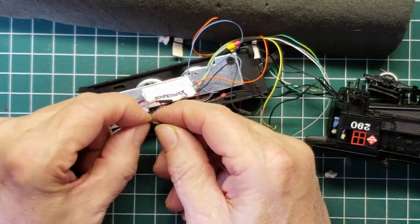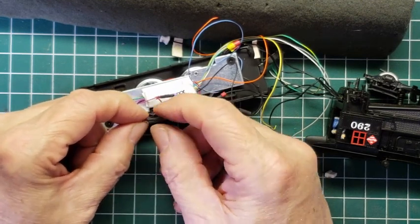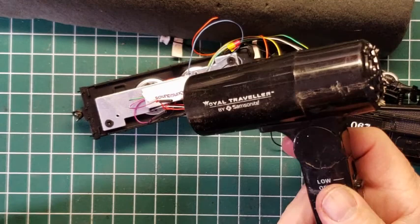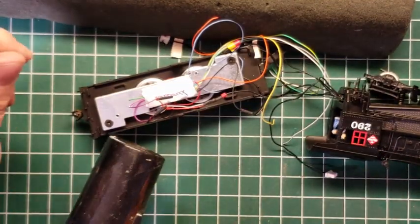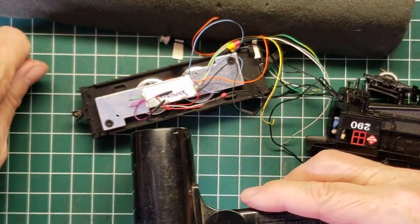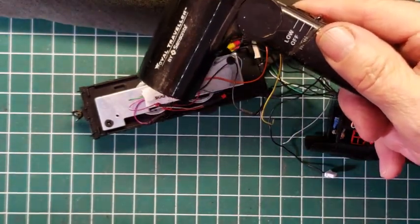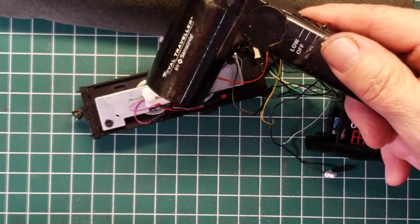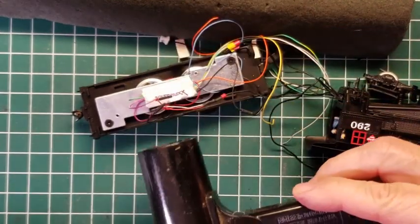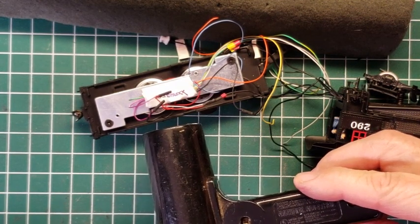Or in this case, it's a hair dryer. Yeah, you can use a hair dryer. You don't have to buy some expensive heat gun. Give it a second to start. You'll see the tube start to deform. That's when you know it's shrunk around the metal.